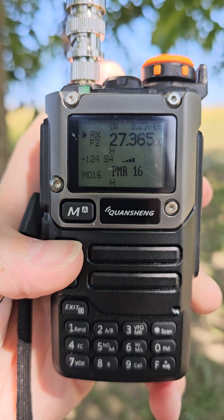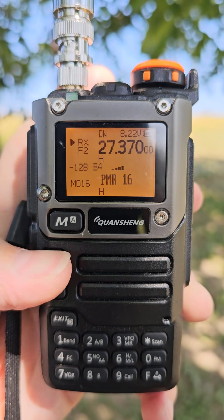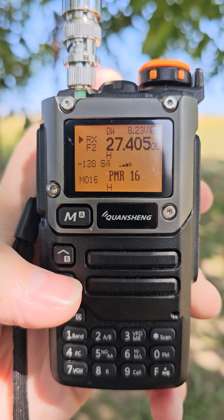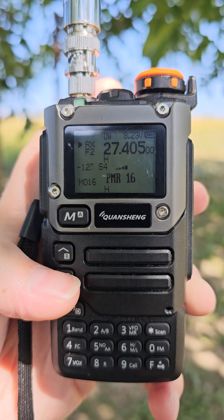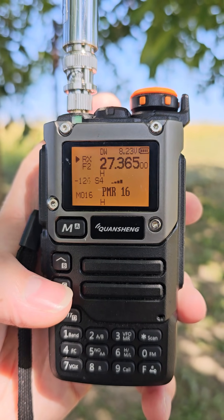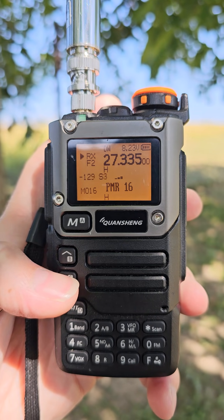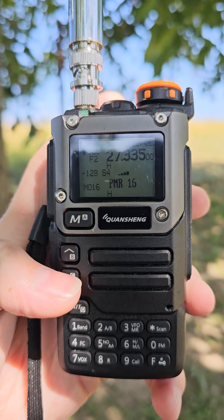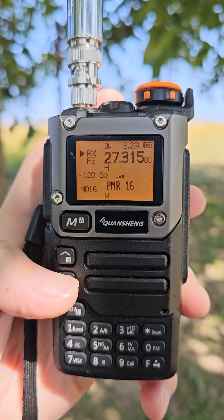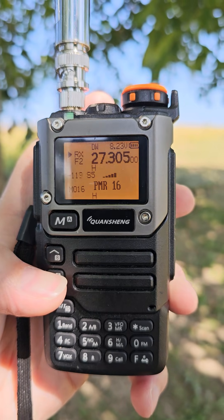The step is set to five kilohertz — this is single sideband received on FM. Another Spanish station deep in the noise. This is the end of the CB band, channel 40 at 27.405 megahertz. Going back — this is AM modulation, somebody's working on AM.